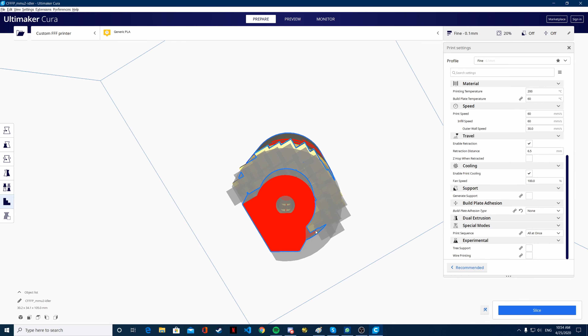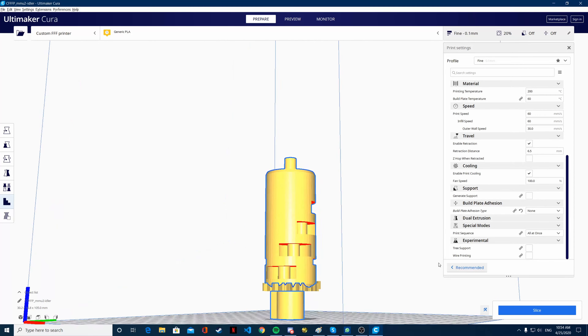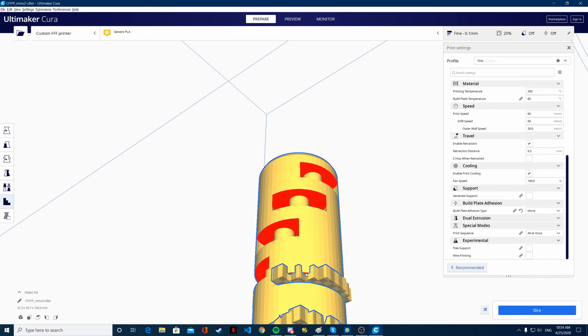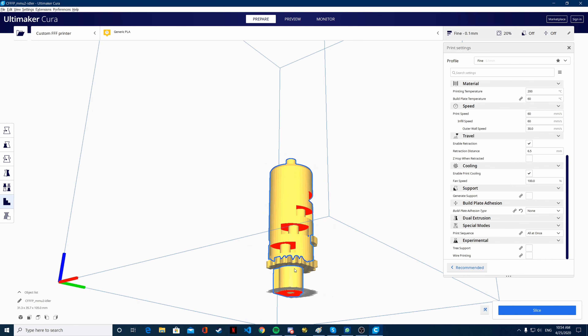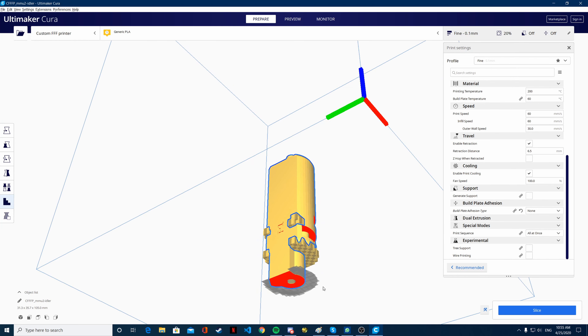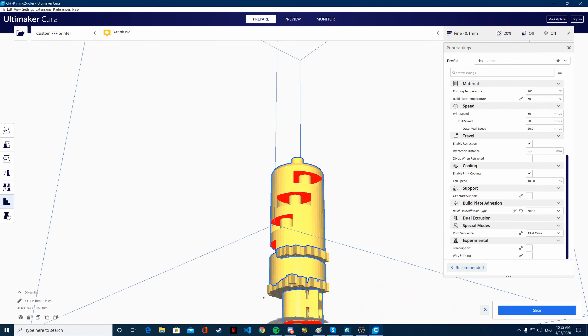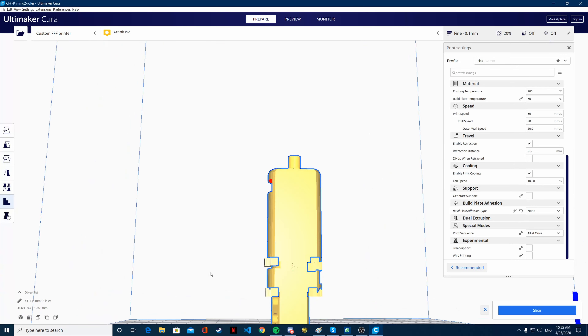It's not the cleanest solution. I could have split the model into two pieces in order to have it do full supports on the lower part and then no support in the upper part where you have the bearings. The other part you want to support is the part with the stop — let's place some supports there. There. And now the holes are also supported. There's also the other small side where I need support. And now you should have supports everywhere. I think it's going to be able to bridge that properly — these are holes, so it should be good.